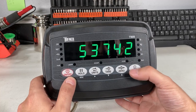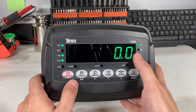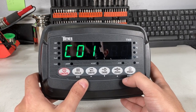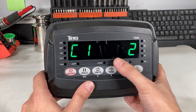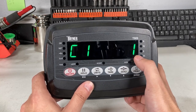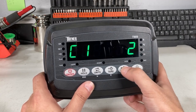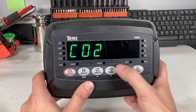Now that the raw data looks fine, press enter — it's 0.0. Hold the hold and print button for two seconds. You'll see C01. This is the calibration menu. Press print to move through: C01, press print, C12. You might have C11 — C11 is for kilograms. I use pounds, so I go up to C12 for pounds.